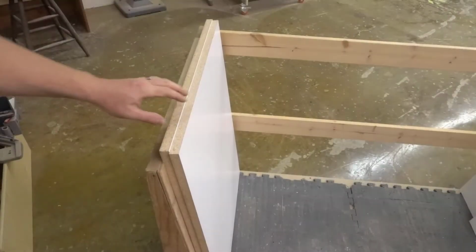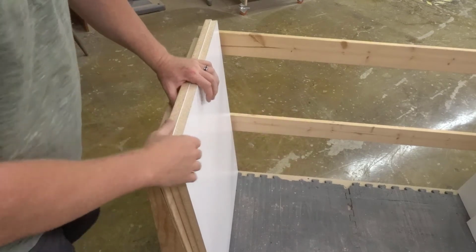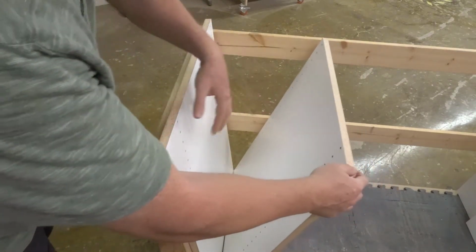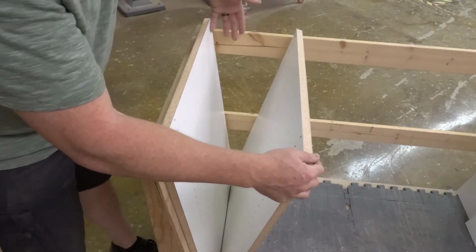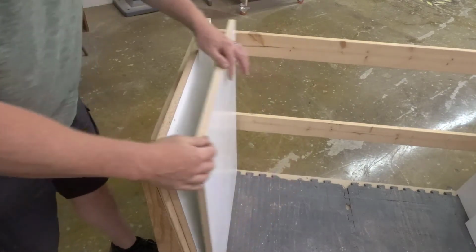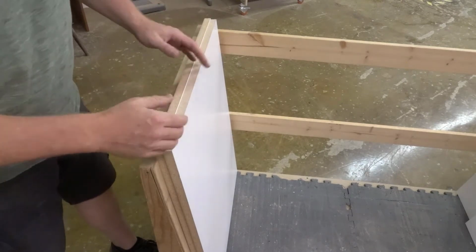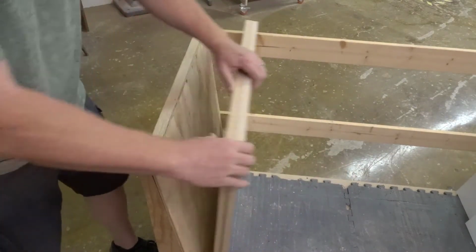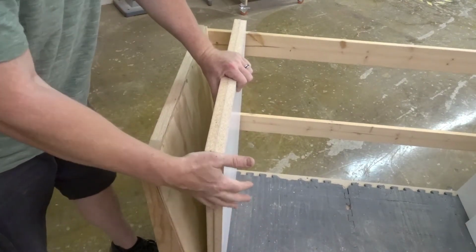When you finish cutting your holes, here's how I want you to line them back up on the cart. It makes it easier. Take them so that they're face to face, holes to holes, and one of these ends is the front, so they're both facing the same direction. Holes to holes, whether they're upside down or not. I don't have my two marks for my bottom, so it's right side up. That I really don't care. I want these holes facing these holes, so this is one set of sides for one cabinet, and that's how I want them put together.